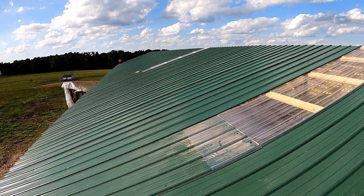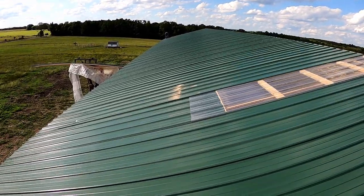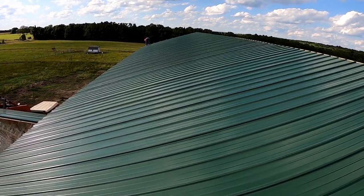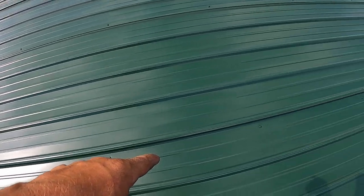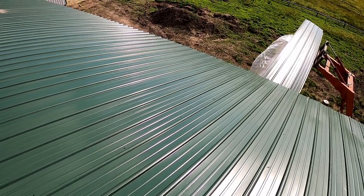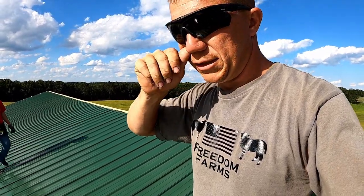But the ones where we know, we marked them by putting screws in both sides on the ones next to them. I know it sounds rough, it's because none of them have screws in them other than just to hold them in place. So right here, you can see that we've got screws all the way down on this side at each purlin, and also on that side. Well, this panel in the middle, the way we did it was we set it to where it's on top on this side, and it's on top on this side. That way, all we're going to do is take the four screws out, basically a screw in each corner, take this panel off, and move it to the other side, because it's going to belong on that side, because we're short on that side, I'm sure. And then it'll be over there to fill what we're missing. It'll make sense.